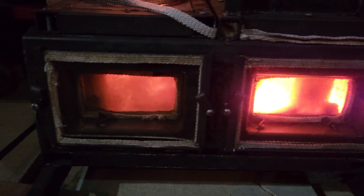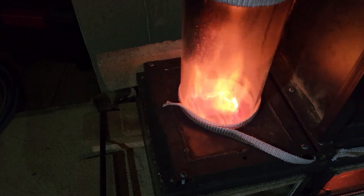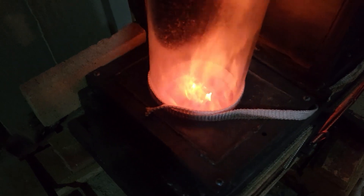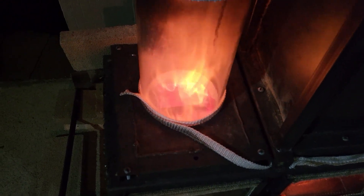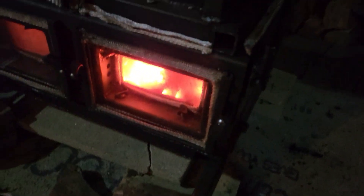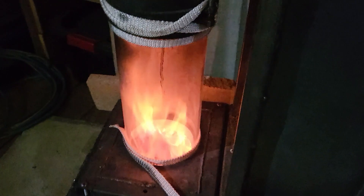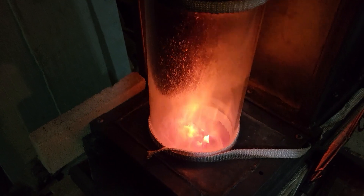I ran it a bit hotter with everything opened up. This is much more the effect I'm trying to get — it almost looks like a gas burning stove, almost like a disconnect from the flame. Obviously the secondary air vertically is still connecting to this horizontal burn. Everything is just super on fire, and most of the air controls are pretty much shut down — little flaps of poor quality — and the dampener is almost completely flat. Really great second and third burns.